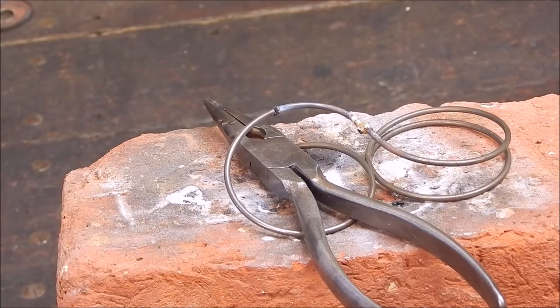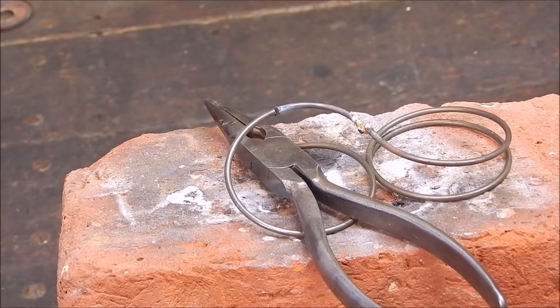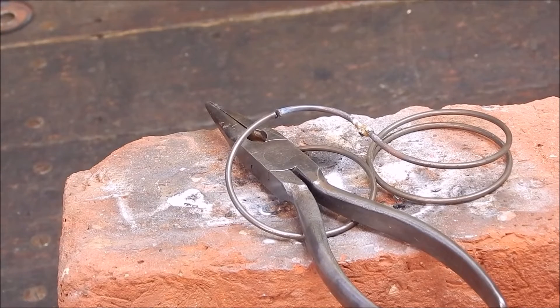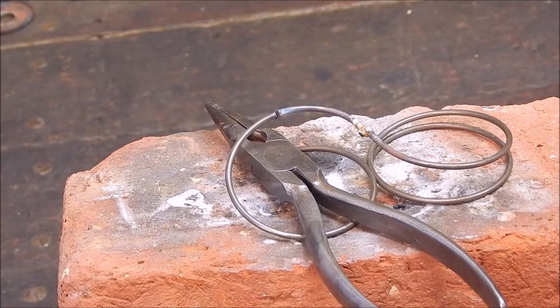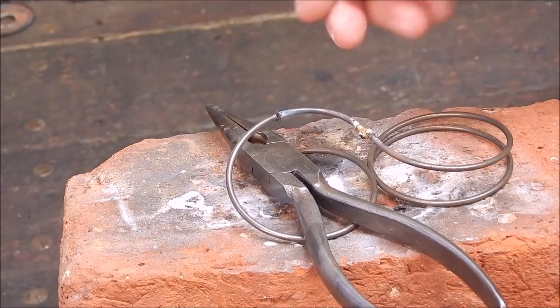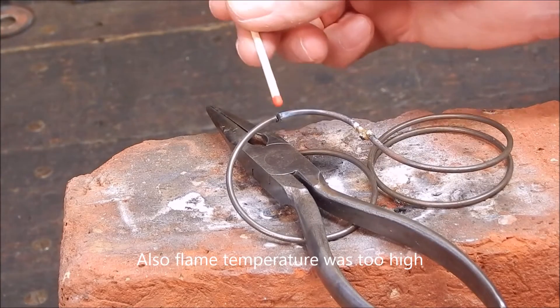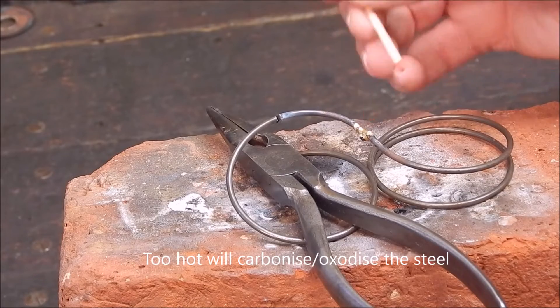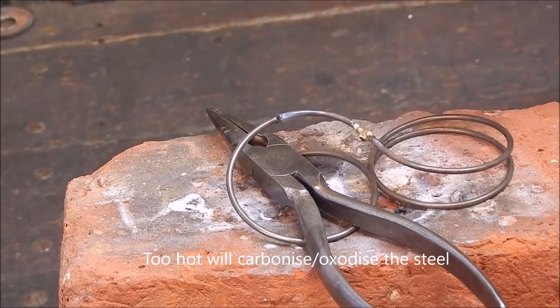I've been playing around with the H160 oxy hydrogen torch. I tried brazing with the standard tip and the flame was too pointed — you want something with more coverage. This is where I brazed it previously with the Bullfinch. There's a big broad flame, a lot more heat.